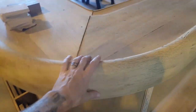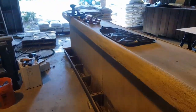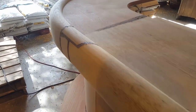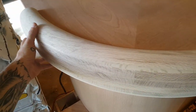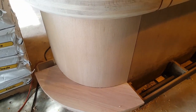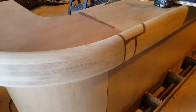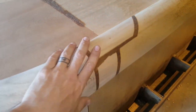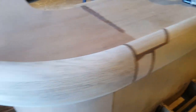At one point they had cut the other end of this bar — you can see there's a radius here. Down at this end they had cut it square for some reason, so there was no radius. So I did a little laminated glue-up to match the bar rail on the other side and did this bent radius with bending plywood and oak veneer. This is just West Systems Epoxy with filling compound to fill in some of my work. After I stain this, this should almost disappear.